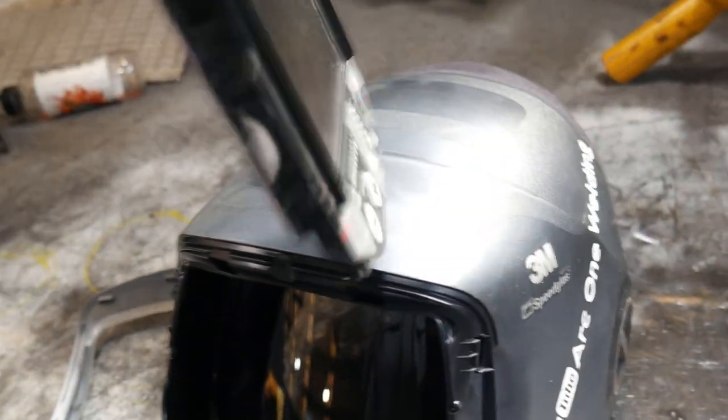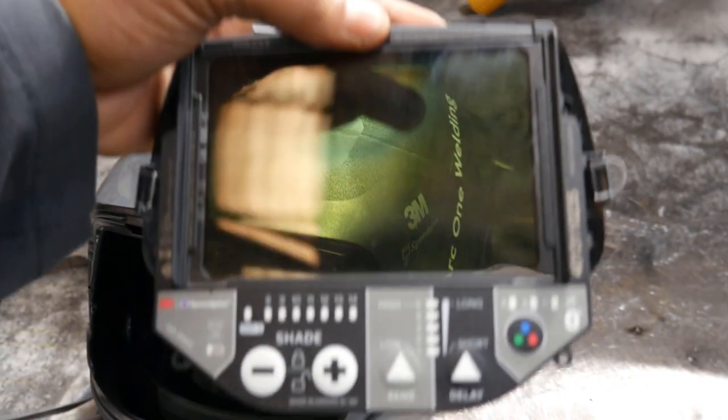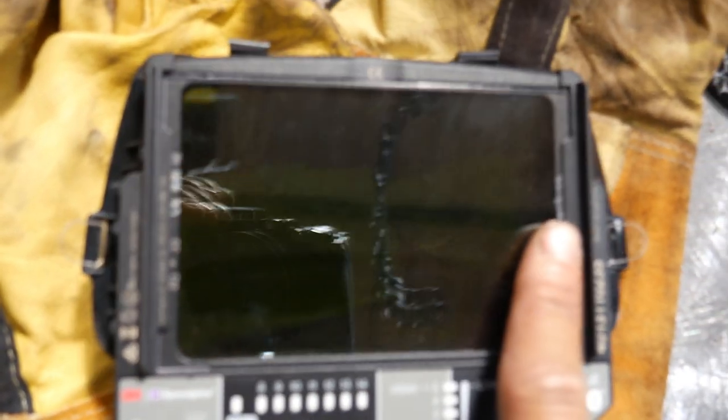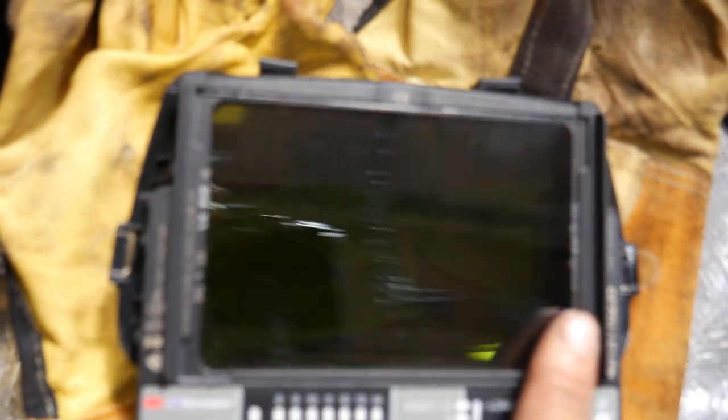But with all reviews you have the pros and you have the cons. Luckily for the G501 the cons are minor and mostly personal preference. Referring back to the FX9100, the G501 still attracts grinding dust on the inside of the filter lens — it's just one of those annoying things you have to deal with and wipe out from time to time. What's worse is grinding dust gets inside the scratch lens, then settles on the fragile glass inside and out. I feel it's a poor design and would like to see it changed on the next mask.